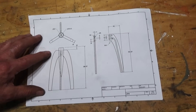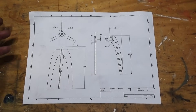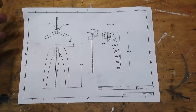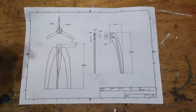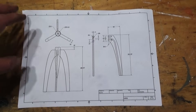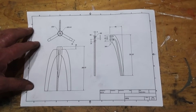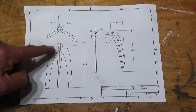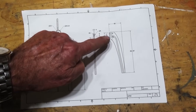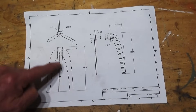These are the drawings for the lamp — I've done these on Autodesk Inventor. The style of lamp I'm making I'm calling a rocket lamp. I don't know if there's a correct name for it, but it's very typical of that mid-century modern atomic age aesthetic. Given the time period, which was post-Second World War, it was the beginning of the space race with all sorts of exciting things happening in technology, and this was the modern design language being used back then. In terms of construction it's fairly straightforward — there's some wood turning, some bandsaw shaping. This leg will be split in two with a channel cut up the centre for the wire, which will go up to the lamp holder, so I don't have the wire dangling down the centre of the lamp.